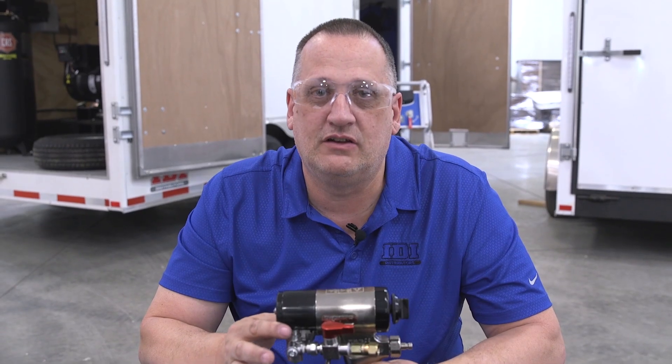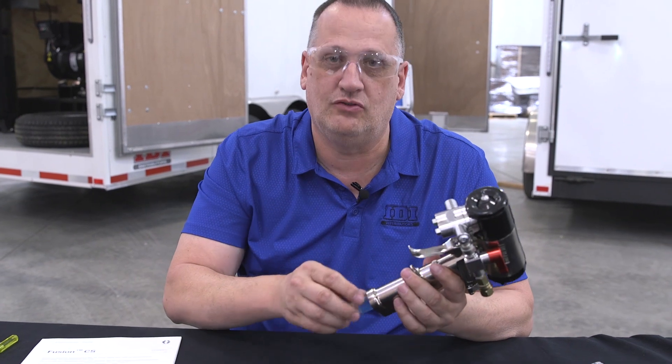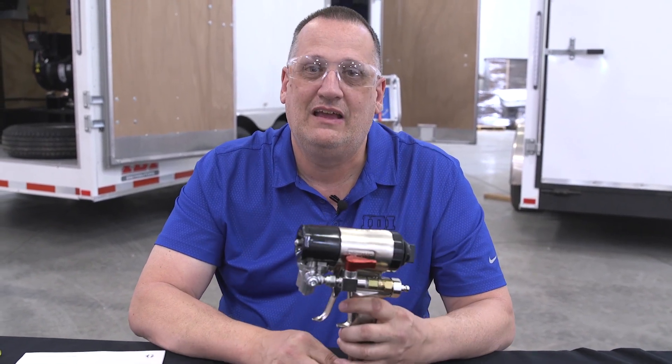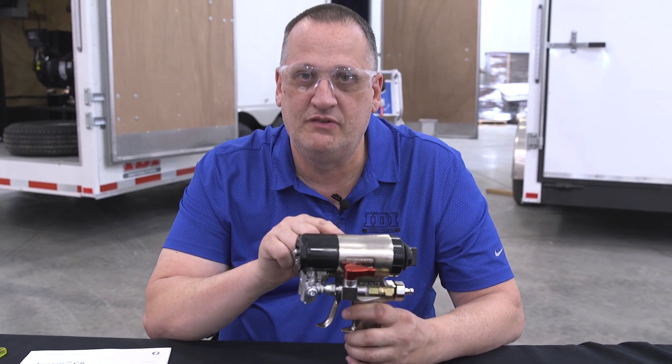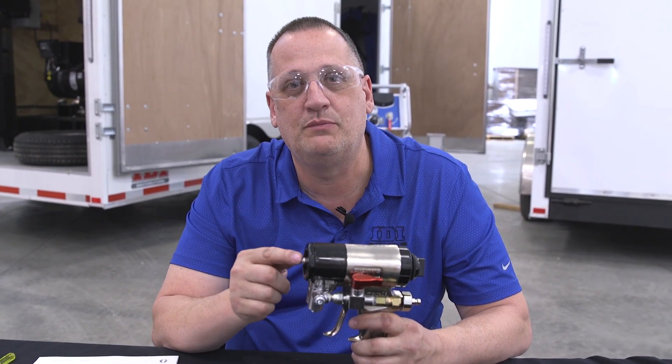What makes this gun a little different than the other ones is that it uses Clear Shot fluid inside the handle. It goes in and pushes up and turns to hold it in place. That fluid, each time you release the trigger, will deliver a little dose of fluid through the mix chamber to help keep it clean.